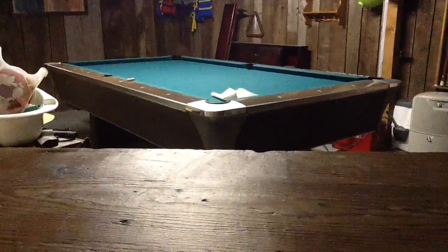I've got some paper towel because I need to wipe down the pool table top — it's still tacky. With this sealant, you can see the mark my finger makes. You've got to let it soak in, then wipe it down, take all the excess off. Then you come back a couple days later and wipe down any excess that's not soaking in. Basically the wood will stop soaking it in, so you just keep wiping until you've got off everything that's not going to dry.